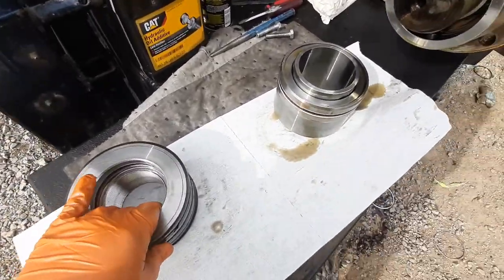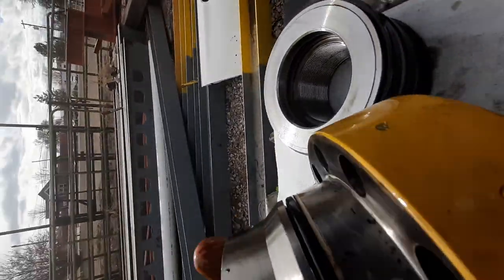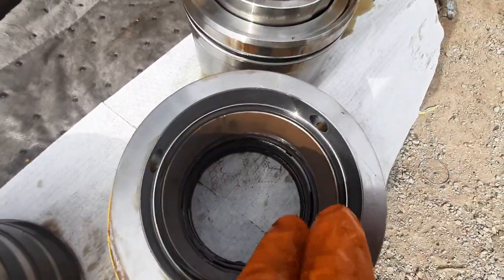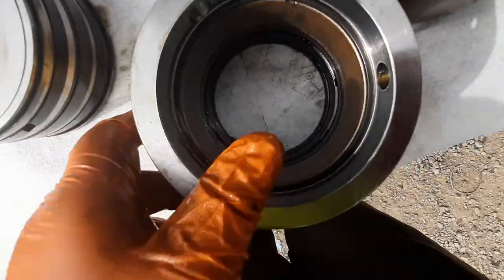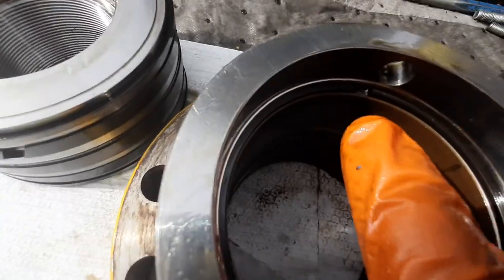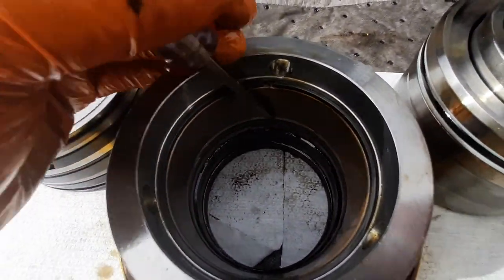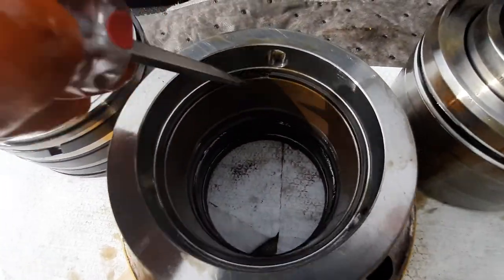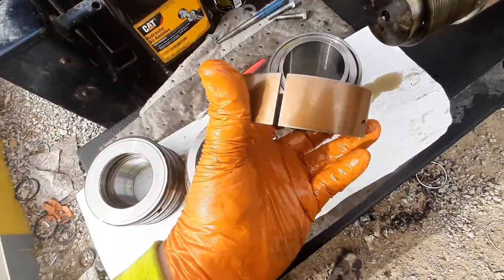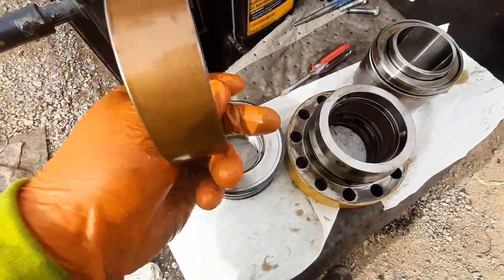I want to show you the techniques I've found for resealing this gland. You're going to have a wear bushing that is pressed in there, and there is a snap ring right here that you take out — you can just remove it with a pick or screwdriver. After taking the snap ring out, look for the seam. Here's a new bushing — you can see it has some sort of nylon in there.